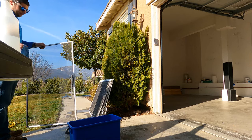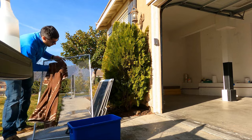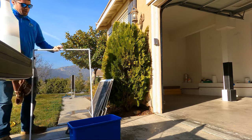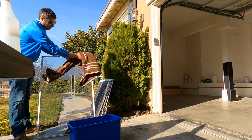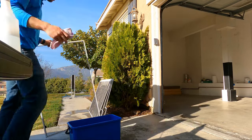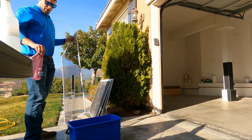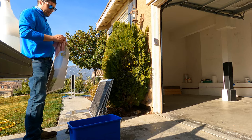After you mop the screen, take your microfiber and tap off the water — same as before. Then I like to take a big towel and dry it off, using the small towel first to knock off the big water. This usually cleans it pretty well. Wipe the inside with the bigger towel too — the inside isn't going to be as dirty as the outside. Then take a terry cloth, dip it in water, and wipe your frames down. Set it to dry just like you normally would with a screen washer. If you don't have the budget for a screen washer yet, you can wash screens this way.